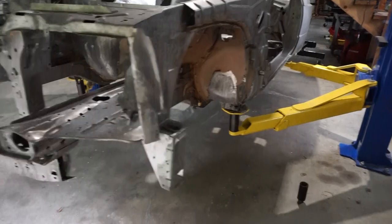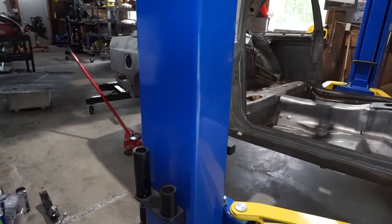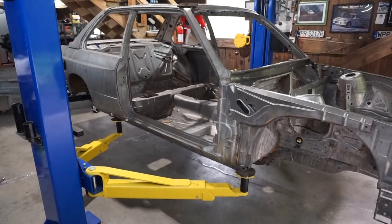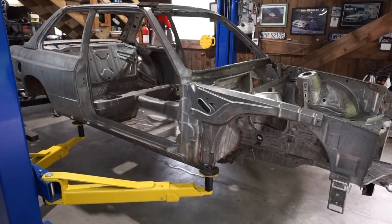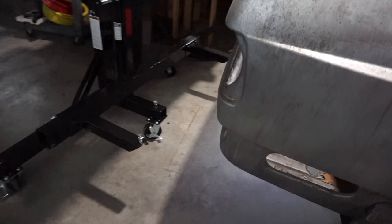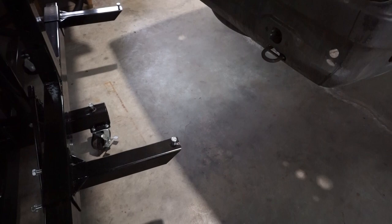The only reason we care about level right now is because we're going to be modifying the ends of the rotisserie to adapt to the bumper mounts, which bolt in. I bolted these guys in and right now the face of the rotisserie is at an angle. I think they assume you're going to buy like two-inch square tubing and make your own thing, but I'm not. I'm going to cut this square, wire brush it, and weld it. I'll try to leave as much length as I can so you can get between the rotisserie and the car if you have to.